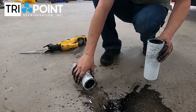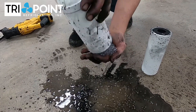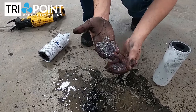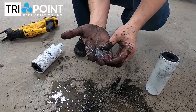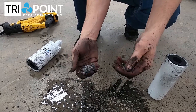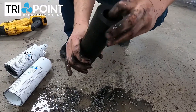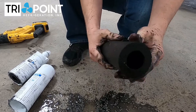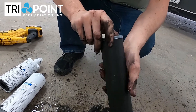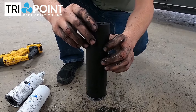This thing is chocked full of phosphate and it seems to be a little bit better quality — look how clear it is. Most of the pebble sizes are pretty consistent. All of our other phosphates had just random sizes and different consistencies. And the activated carbon block — it's not mushy. The other ones you can kind of scrape away, but this one you can't. That tells me you're going to get better quality filtration; the water is going to permeate through that filter and give you more contact time to pull out chlorine.